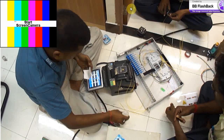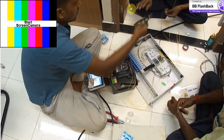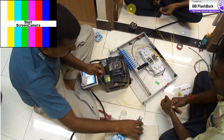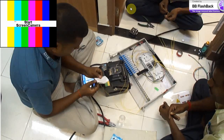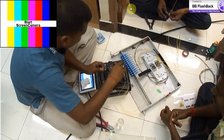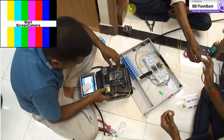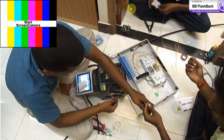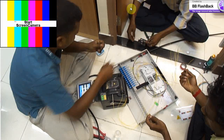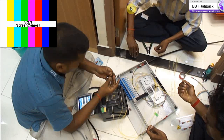We are cleaning this fiber now. The jelly on the fiber cable is being removed using thinner or a solvent. After cleaning the gel from the fiber, we use isopropyl alcohol for fine cleaning, which gives a very good, sharp, clean environment for the fiber.